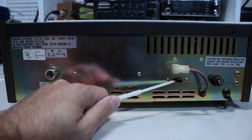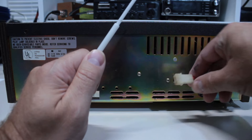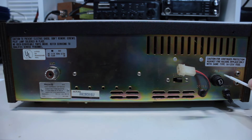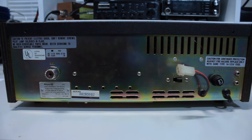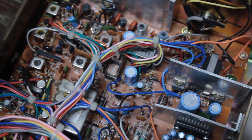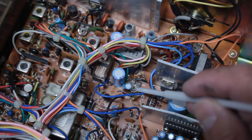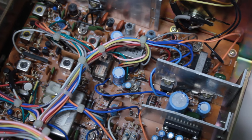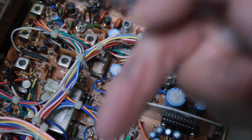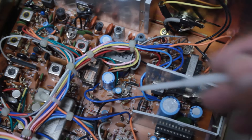Let me show you the calibration function. We'll switch the radio into AM mode. You can see our calibration meter and SWR meter here. We'll key up and adjust our calibration meter until it's right in the middle on the Cal setting. It's telling us our SWR is just under 1.5 — that's not fully accurate because I know our SWR is actually lower than that, but it's well within the safe range. The radio does about 10 to 12 watts on sideband, and on AM about 2 watts dead key with about 10 to 12 watts on swing. Not a huge powerhouse, but that's okay for one of these older radios — I wouldn't try to squeeze a whole lot of power out of it.